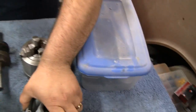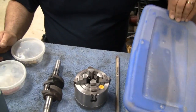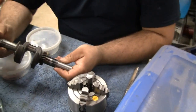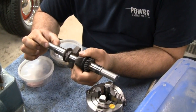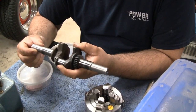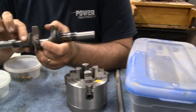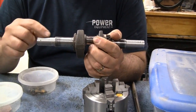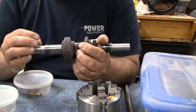You cut this crank down as much as you could, and you couldn't go any further because we had to get the four-jaw. And now you just have to take off maybe a thousandth or two. Yeah, I remember. The ends of the crank that we welded up and began to turn down are not, what's the word, concentric. Well, they're round, they're concentric, but they're offset from the actual bearing journal surface here. So if the journal was running true, the tip here would not be true to this. So the diameter is round, but it's offset, almost like it's a cam, you know?